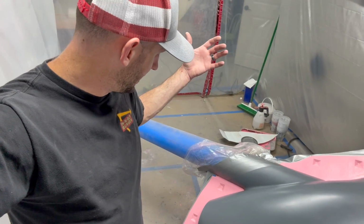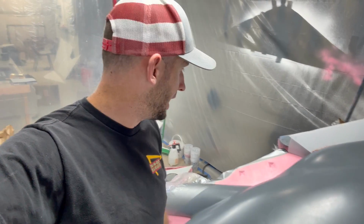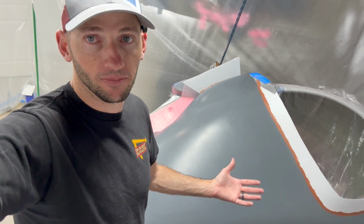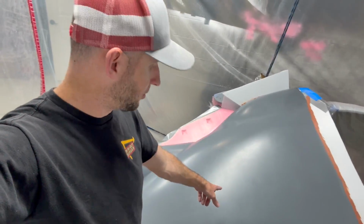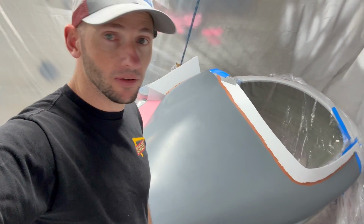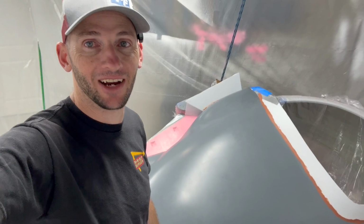I also thought it might give me a little bit of an air gap between the 2 flanges when they're fully cinched together, so that I can get a wedge or something in there to help me with demolding. I don't know, I've never seen it before, but I figured it might work. We got everything down, another 4 coats of wax actually. So pray to whatever gel coat god you believe in and send some luck my way. Here we go.